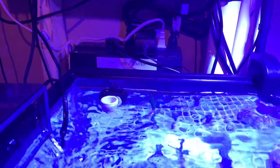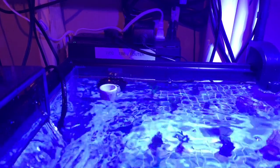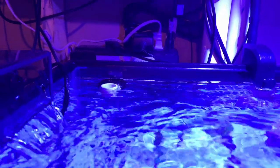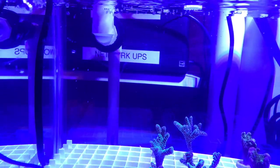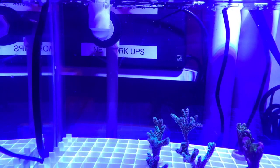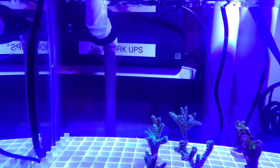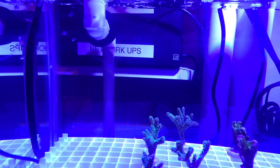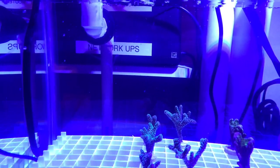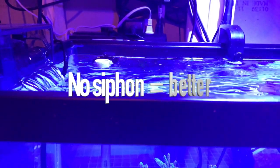Here's the drain line overflow — you can see it's a PVC elbow. I also switched to PVC downline here, running back out for about two feet, and it runs down to my three-eighth poly. I needed some space there for the air and water to separate, because the siphon that was forming was not working sufficiently to drain this, but now it works.